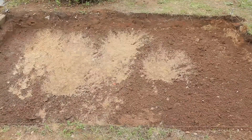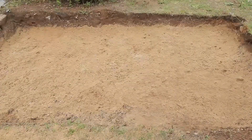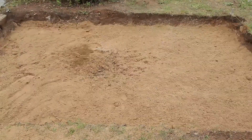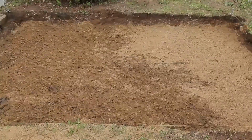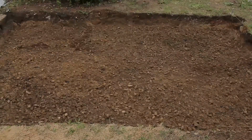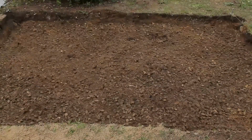After that, we begin to fill in the dugout space. We lay about 10 centimeters of sand at the bottom. Sand is necessary if you live in regions with high groundwater levels, enabling the entire system to maintain a constant appearance. The next layer is a gravel crushed stone mixture.